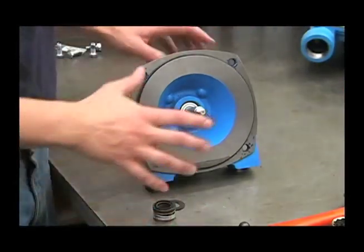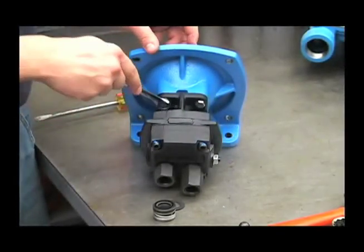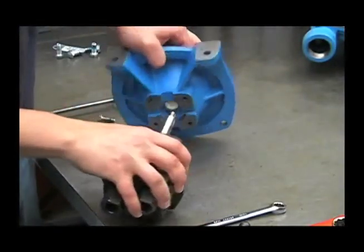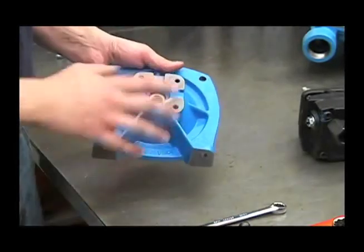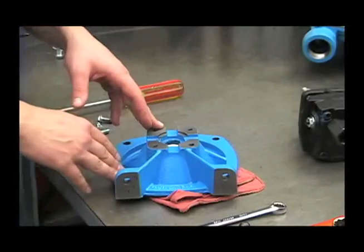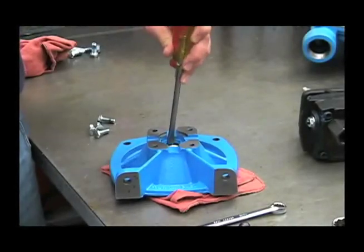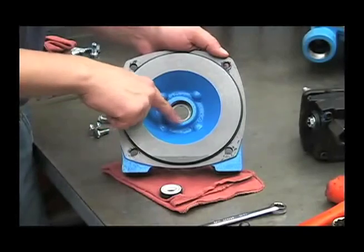We're actually going to take the flange off first and take it out from the backside. To do that, take your half inch wrench and remove these four bolts. Pull the flange straight off of the motor. Now we'll remove the seal seat from this side. If you were going to try to reuse a seal, you'd want to put a rag down to help protect the seal from any damage or dirt. You want to make sure that you have a very clean work area. The seal can be tapped out from the backside gently with a screwdriver. You can also look at this area for excessive corrosion.